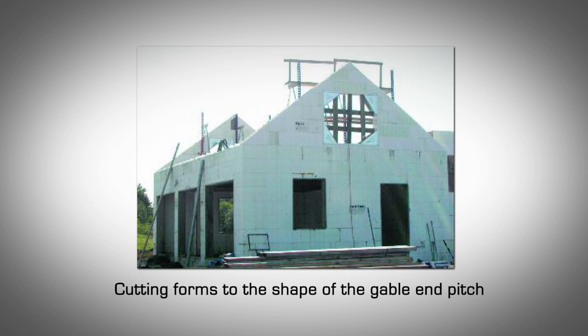Gable ends. Gable ends can be formed using one of two methods. Stepping forms: form the gable end by stepping the forms back as you stack to the peak. Block off the vertical ends of the forms and pour concrete. After the pour, the rest of the wall is framed in. Cutting the forms: form the gable end by cutting the forms to the appropriate slope of the roof. Secure lumber to each side of the forms so the top of the lumber is aligned with the top of the forms. This gives added form support and provides a furring surface to fasten plywood. Cap off the top of the forms if necessary.